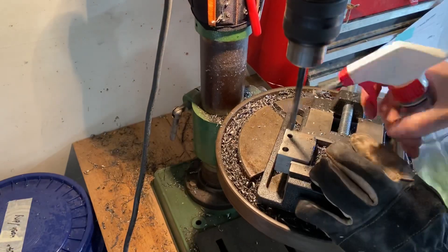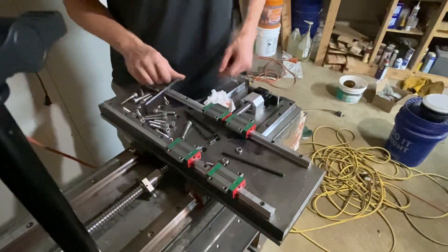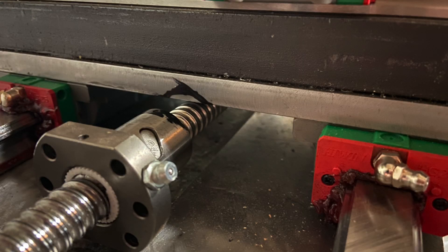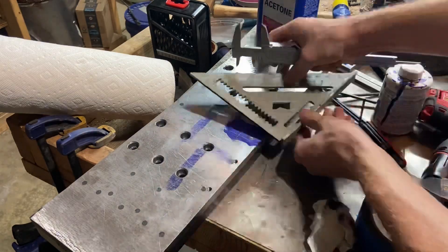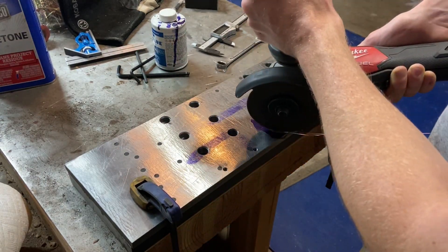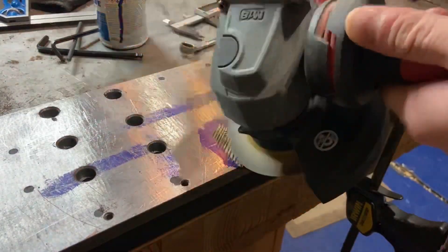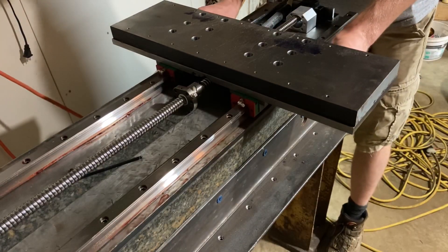Now here I'm taking the strong side support and just drilling out those holes a little bit wider — I just need a little more play to make sure it's fully aligned. Then begins me slowly losing my mind. My plan is to use just the nut and basically carve it into the bottom of my cross-slide carriage, then put supports around either side of it so that way it can bolt into the carriage directly. I tried carving it in with the angle grinder, and this kind of worked, but when I started looking at what I'd actually need for supports and drilling holes to get it all squared up, it started seeming like I really wasn't going to get a great fit. So I ended up changing my approach later.